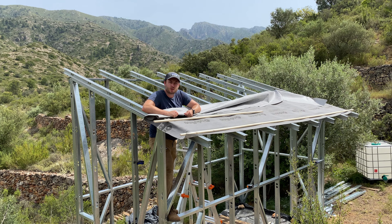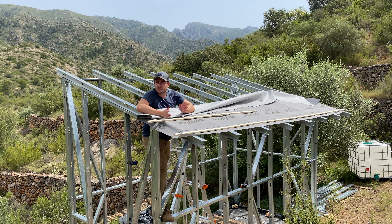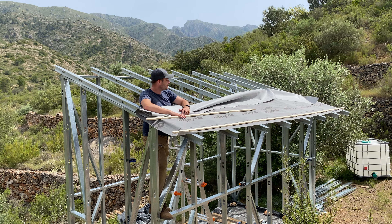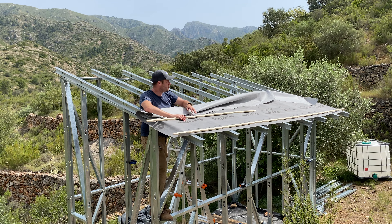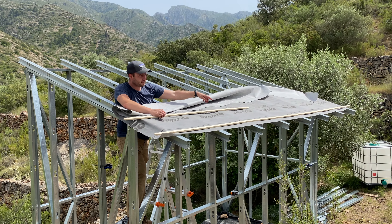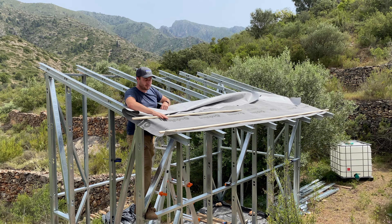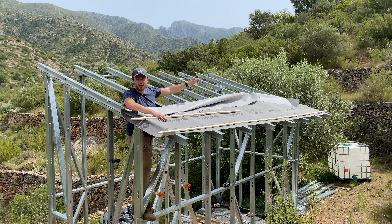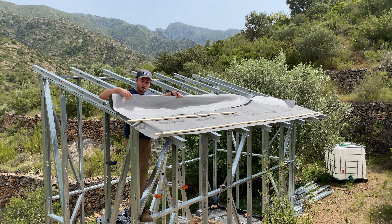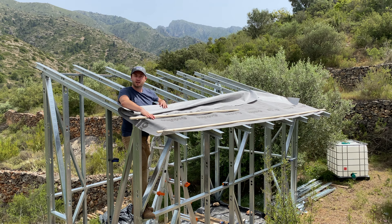This is the vapour barrier we're putting up on top — it's a long roll and we've cut them to four and a half metres. The roof space is 420cm so we've got a bit of overhang on either side. These are the battens we're putting on top; they're two-metre battens. We've got some calculations to do so we don't have overhangs in the middle. In the centre we've got two metres on either side and a 58cm piece in the centre, then on the next one we do two metres, two metres, and calculate the end piece, just to stagger where we have that singular small piece. We've laid it on and folded it down so we can get to where we need to get to.